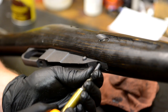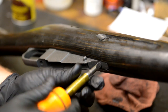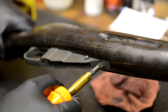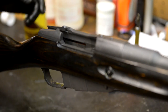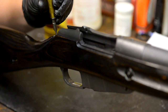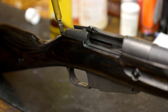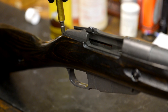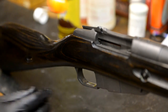We're going to start the front screw first. Don't worry if you get some Acraglass on it — all it's going to end up doing is giving you a tighter fit anyway, which is what you want. Don't tighten it down monkey tight, but get it pretty tight. Go ahead and put the rear screw in, get it down pretty tight, and then we're going to fill in even more glass to make up the difference. Watch as I tighten this — you should see it kind of start to flow out a little bit along the sides. There it goes. That's about as tight as we want to get that.